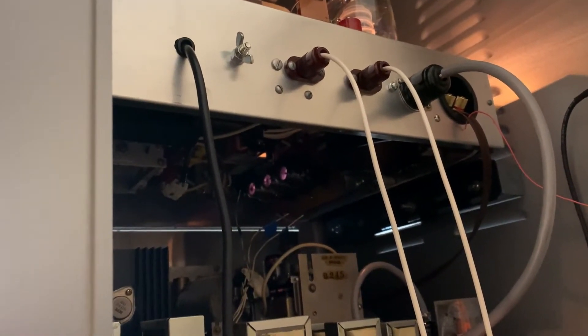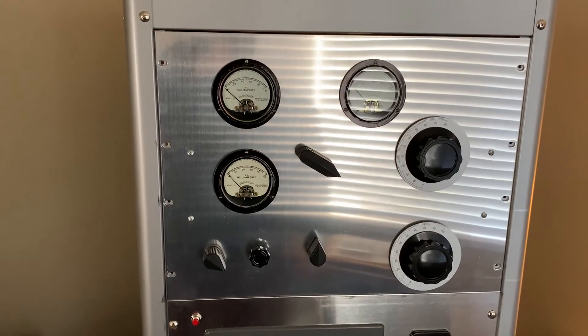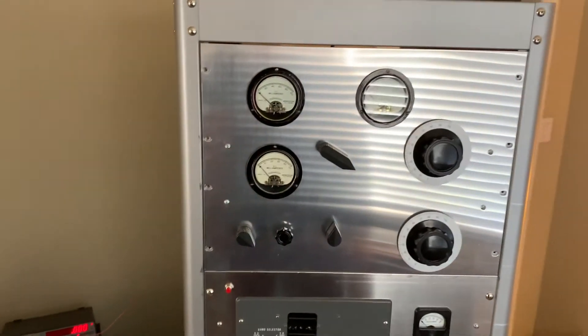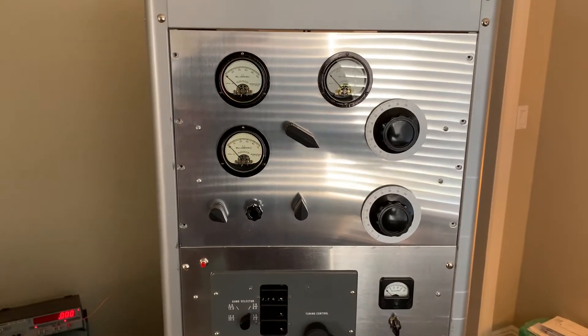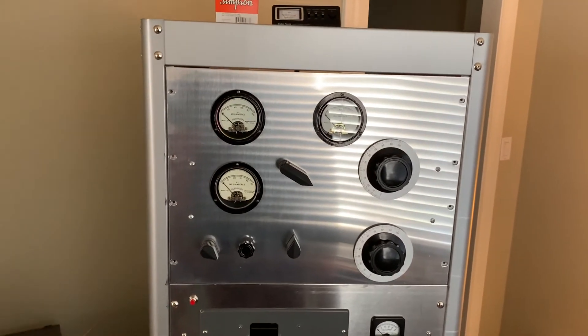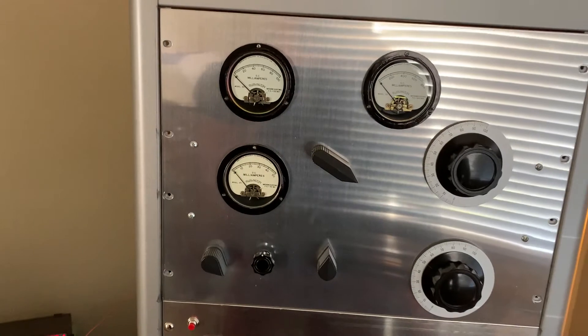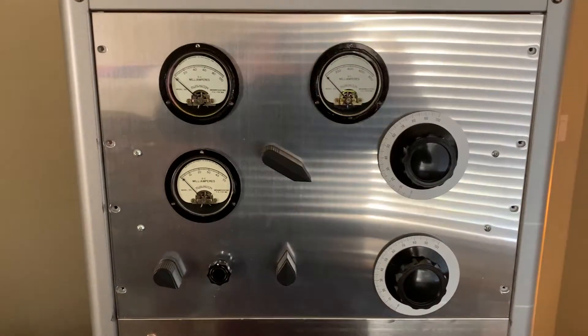See, they really dim — they were lit up brighter than that yesterday. I also blew the fuse in my little cheap meter I bought yesterday; that meter is only good for about 600 volts. I ordered another meter that'll handle like 1,500 volts DC by itself with no attenuation probes — it's one of those cheap ones on Amazon, about 25 bucks. I'm going to measure the screen voltage as soon as that new meter arrives tomorrow. I also need to check the negative grid voltage under full drive — it dawned on me I never put a meter on it to see how far that voltage was going down.